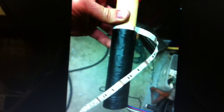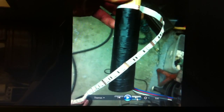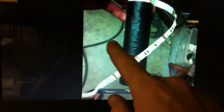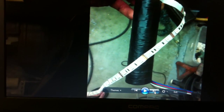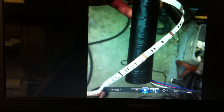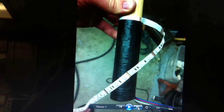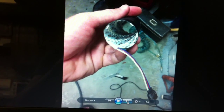Here I'm just wrapping the RGB LED strip into a nice tight spiral and then I went around the outside with black electrical tape to hold it all together. I don't know what size the dowel is but it worked out just perfect. The outside diameter once the tape was on is just less than the inside diameter of my acrylic tubing, which is an inch and a half. It held its shape really well — I was really pleased with that.